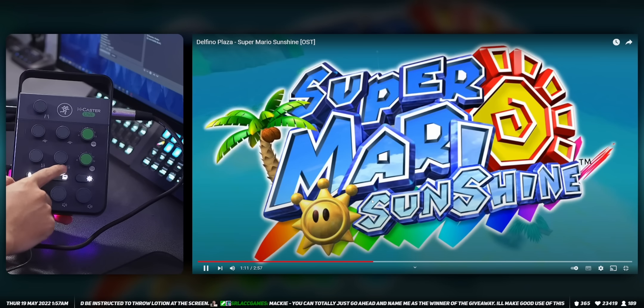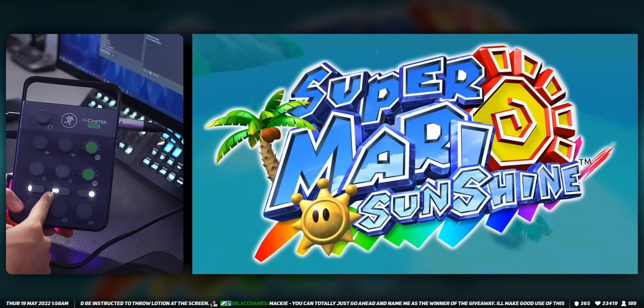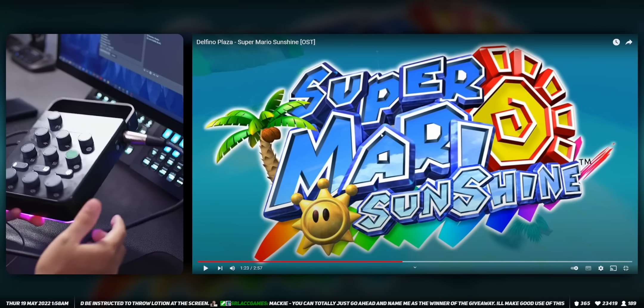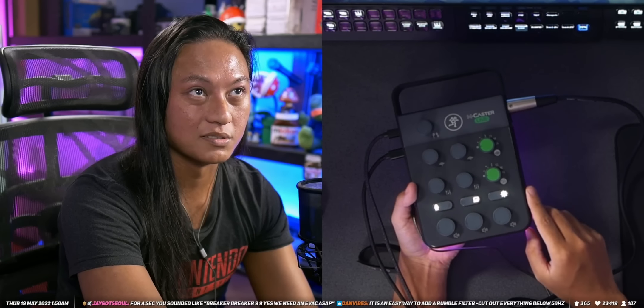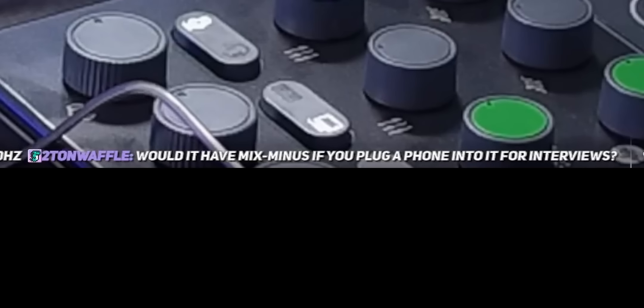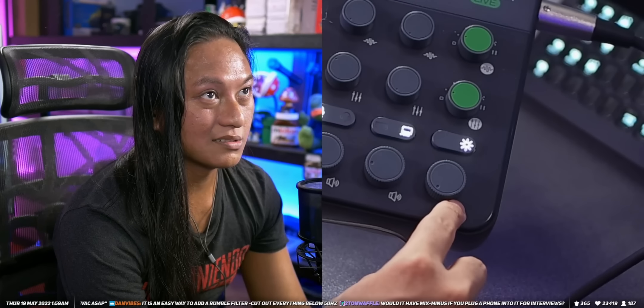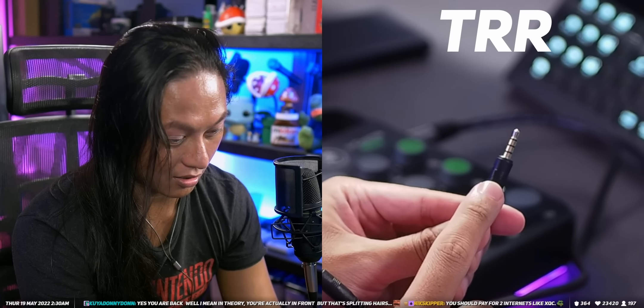This button is for RGB lights, and this one is for switching between an instrument input and PC input — we don't have anything attached to the instrument line yet, so this does nothing right now. The next thing I wanted to try is connecting my phone to this. That was what was really appealing about this device — seeing if I can get an XLR mic plugged into my phone for an IRL stream. This also supports mix minus, so you'll have all your audio minus the phone's audio. You need a TRRS cable to get the mixer's audio into your phone.